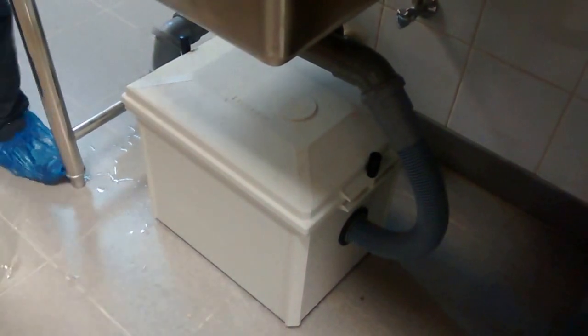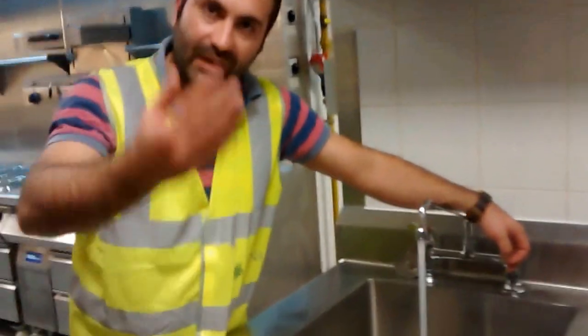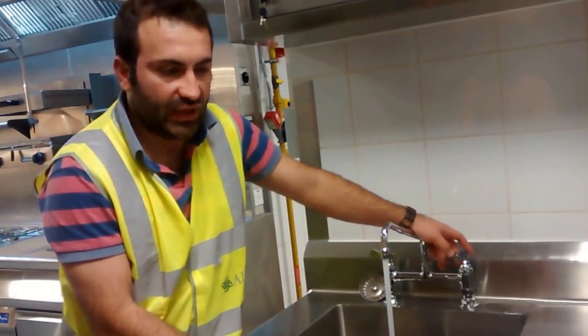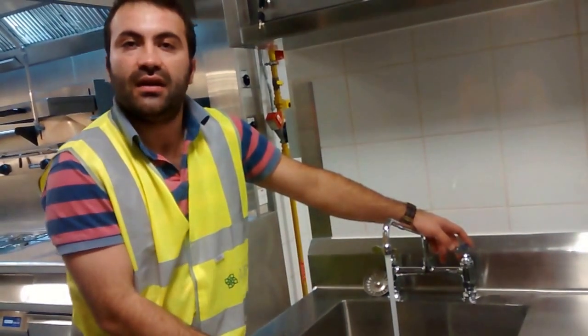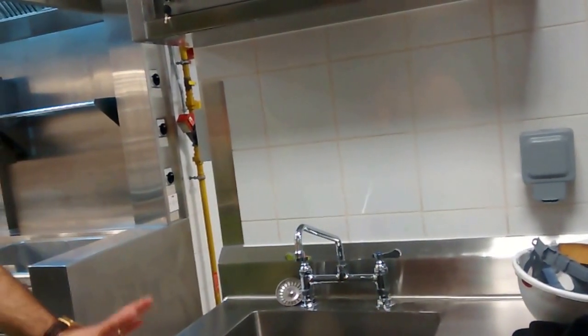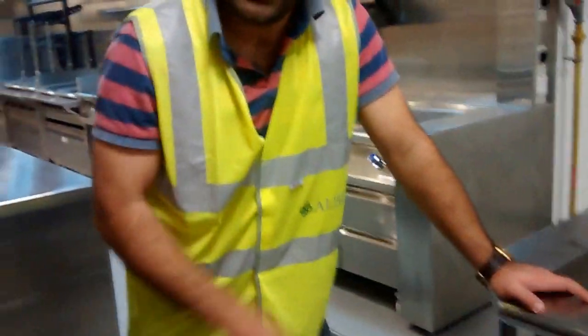And then once you're finished, we need to make sure we open the system with water so that it's filled with water, so that later on when you want to have the separation again, it will be much easier to go by specific gravity. We open it for like 2 minutes. We make sure that we have the 14 liters. 14 liters can be achieved if we are saying per second we are having 0.5. 14 liters can be achieved in less than, let's say, half a minute. For 30 seconds we can fill this one. Then we close to make sure that the system is operating normally. Any questions? This should be daily basis? This should be daily basis.